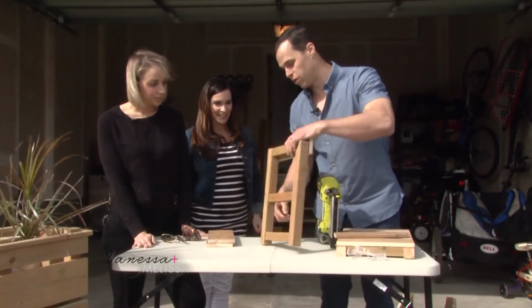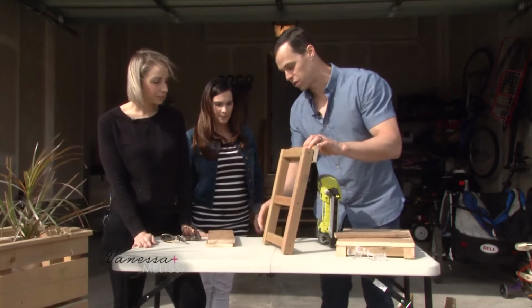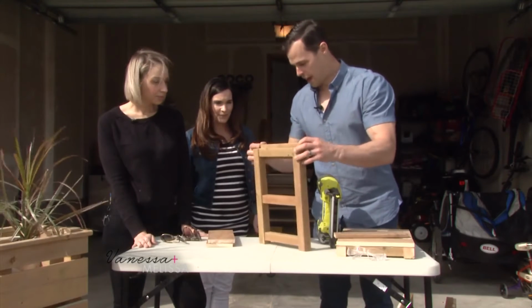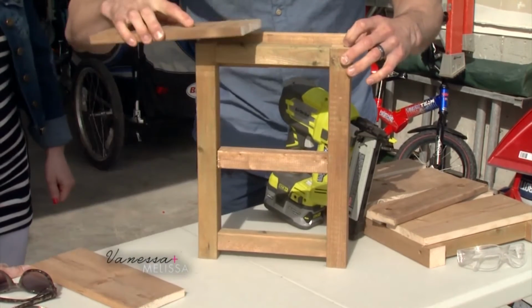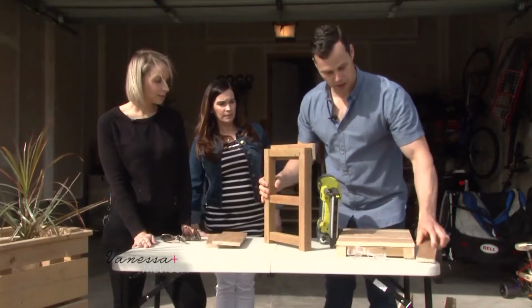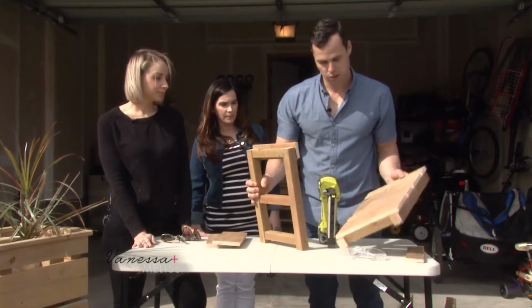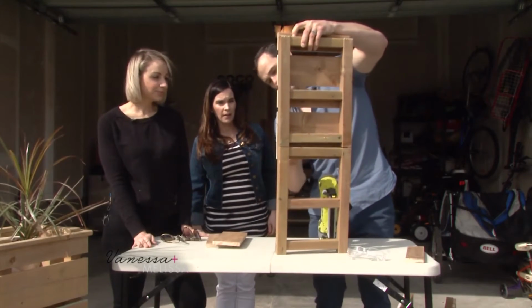And these are all made out of old balusters, like little spindles on the railings. I cut them up into short sections to make it about stool height. The key is the first piece I staple on is set down the thickness of a board. Why do I do that? Because when I go to stack them together, you have to have that clearance for the little feet to catch in. So we add that little bit right there, so then they lock together on a perfect seam.